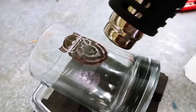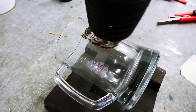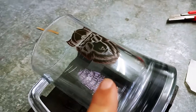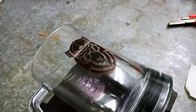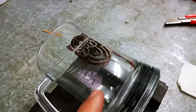It needs to be nice and hot. We must heat this up properly so that we can clean over the logo once it's cooled down without damaging it. You can see there's a magenta edge — that is a registration issue. To fix that, go on the printer, click menu, go down to calibration, and you can fix your registration that way.